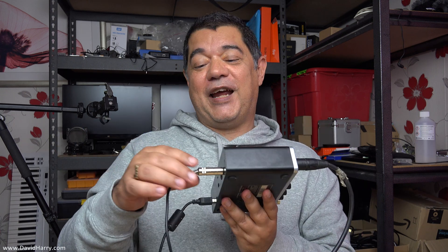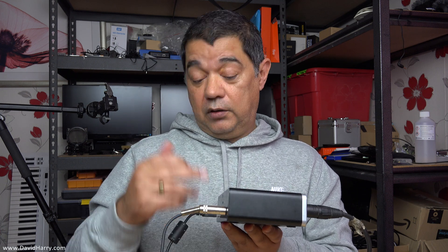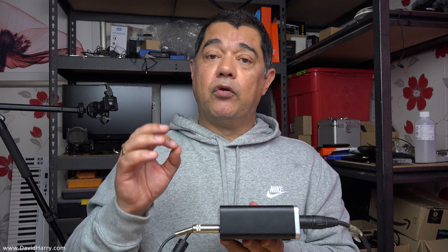On the back it's just a line out to the camera. No need for balanced on this system since the camera isn't balanced — although the output on this unit, despite being on quarter-inch jack, will do balanced over quarter-inch TRS. But honestly, regardless of what you may hear, there is no difference whatsoever in sound quality between a balanced and an unbalanced system. Balanced in a nutshell is mostly used for very long cable runs, or for certain peak voltage settings between amps, preamps and line equipment.